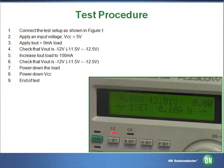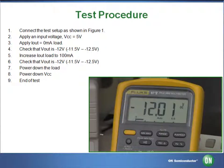Next, we're going to have our DC load set to 100 milliamps in constant current mode. Also note that our output reads a positive 12 volts on the load, because the load is hooked up in reverse to the actual voltage polarity. We're going to turn it on, and here we can see that our output under load stays at our approximate negative 12 volts.